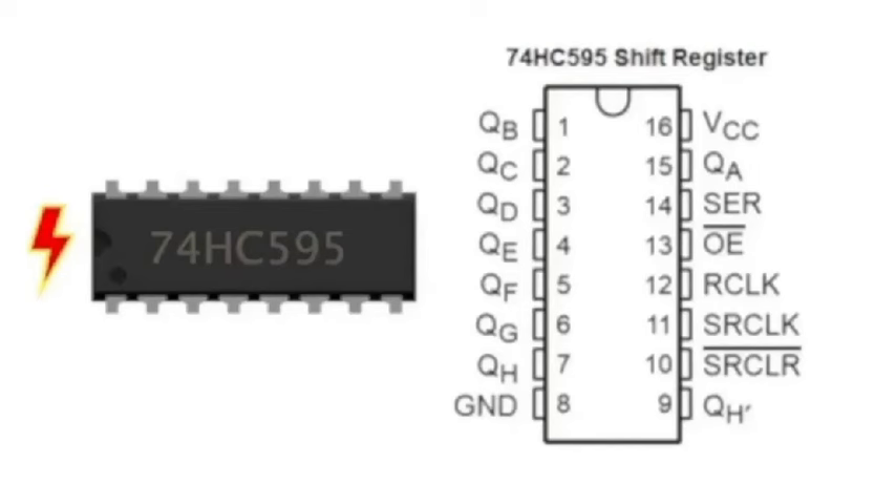I'm going to work with the 74HC595 shift register. I know nothing so far about the 165 shift register — I just know that one takes parallel in and comes out serial, and the other goes in serial and comes out parallel, which is the one I have now. These shift registers can only run between three and five volts, and my Raspberry Pi only outputs between three and five volts, so I'm good to go with five.